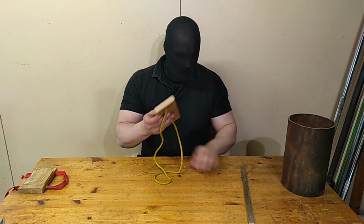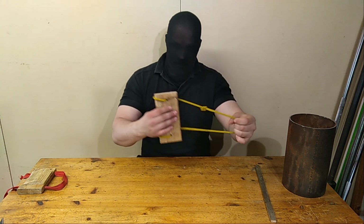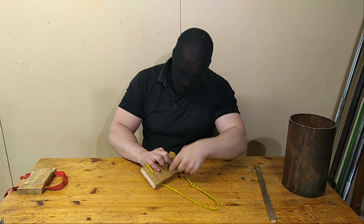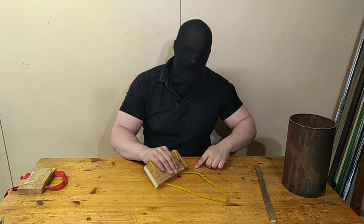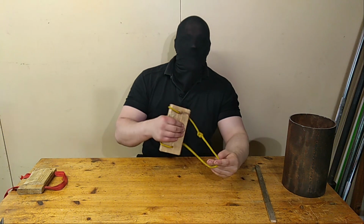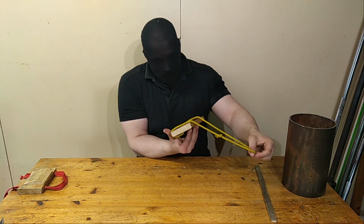So you can think about this like so. You have a handle like this, and now you can think that here your fingers are pushing in from here, and the rope is pulling from here. The point where the rope is pulling is further away than where the fingers are pushing in. Hence, in this handle, torque is created, which tries to turn it like so.